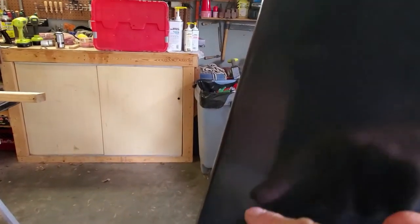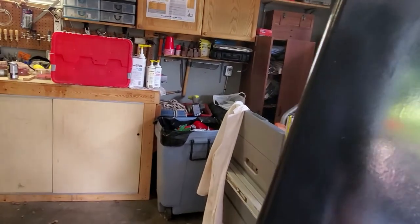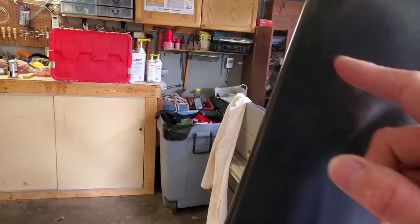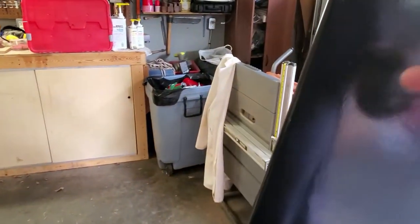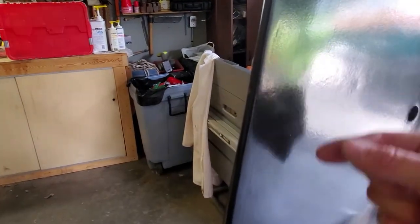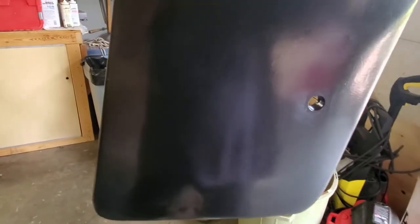There is a big slug of lead in this board. The board is made up of one piece of three-quarter-inch plywood, and there is a center lead slug of about this rectangular shape. I always take bronze ring nails and bang them into the side — usually three or four along each edge, including the ends — so that when the lead solidifies, it has something to bite into mechanically. It's mechanically held in place, and then I fair and cover the entire surface with fiberglass cloth.